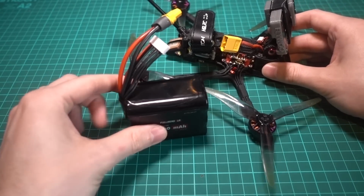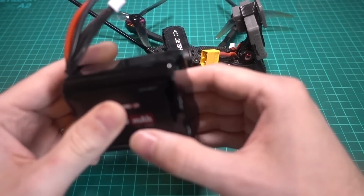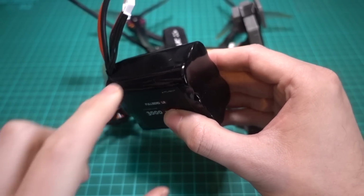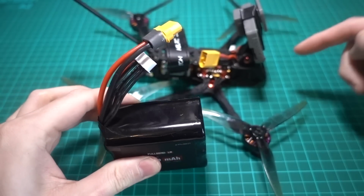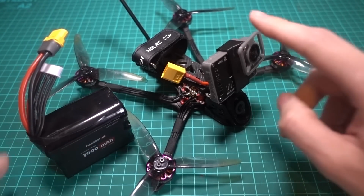But here, we've got lower current, higher voltage. Does mean that the pack's heavier because essentially we have got 2 of these 18650s extra than the 4S. Got an XT60 connector as well, which connects directly to this quadcopter. It's almost like it was designed for it, except that I did have to give a completely different tune with this guy.